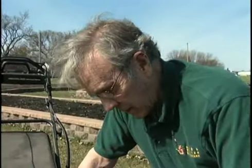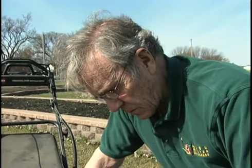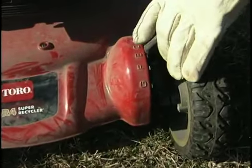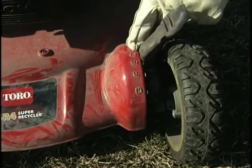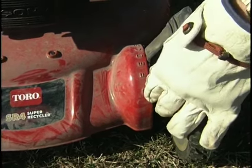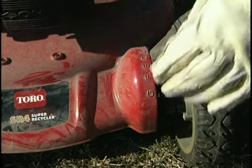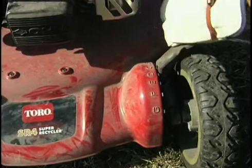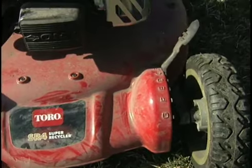What we have here is a mower used last year at the standard mowing height of about two and a half to three inches — a good height to maintain your lawn all summer long. For this purpose we're going to drop the mowing height down to roughly about an inch. On this particular model the settings go from A through G, with G being about a four-inch mowing height, so we're going to drop it down to roughly B, which should bring us to about an inch mowing height.